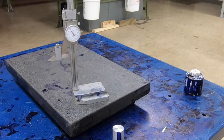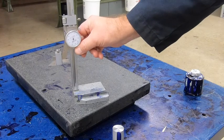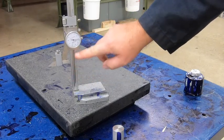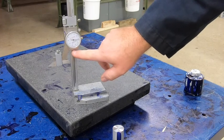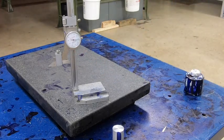Remember, we can only do one measurement at a time. The longest measurement on this project is 2.75 inches, so we'll use the height gauge for that. It reads exactly the same as a dial caliper, but you're looking underneath it to get your measurements off the edge.